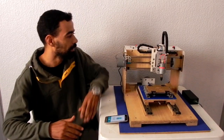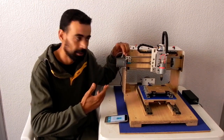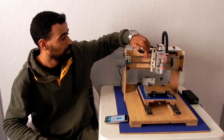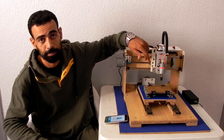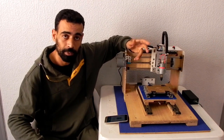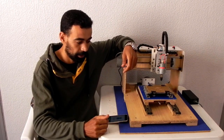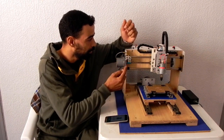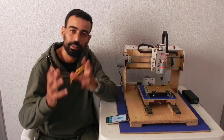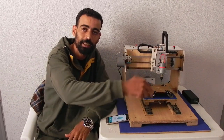So, it is a desktop CNC milling machine that I built from junk, from some parts of printers or inkjet printers, like this axis, stepper motors, and other parts from anywhere I buy locally, like the wood, aluminium or plexiglass for nice design. It is a three axis machine, X, Y, and Z,